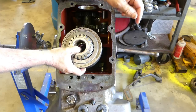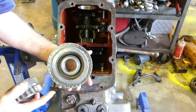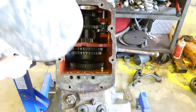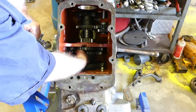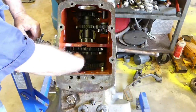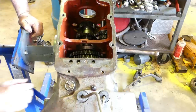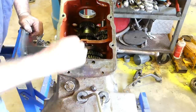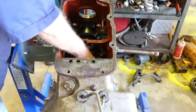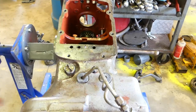Now this is your multi-power clutch pack. It's just a multi-plate pack. It's got piston rings around the outside. We'll pop that apart for a look for sure. Now on the bottom here, what they tell me he's done is he's put a spacer in where that bottom spring is. So I think we'll have to roll him back again.